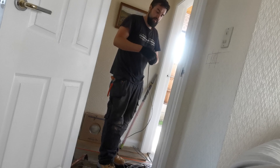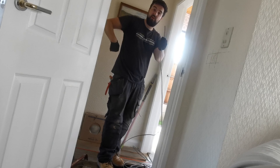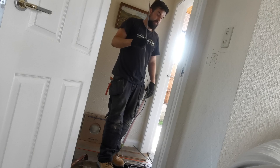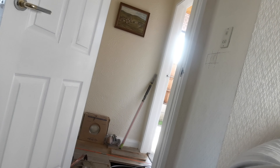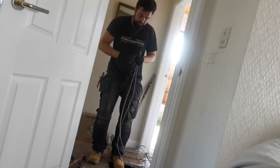It's just starting to heat up now so it's actually roasting. We're going to put down another sheet just to keep the carpet protected. We managed to get all the furniture to the inside of the room and then all this here we've managed to flap back. We're going to run a cable from here to each wall, going under this hatch all the way to the end, then they're going to split off left and right. What we can do is measure off the cable, chop it, and then run two at the same time so we don't have to run it twice.